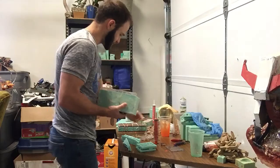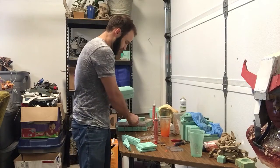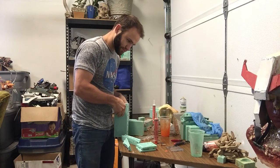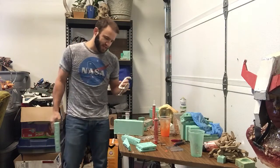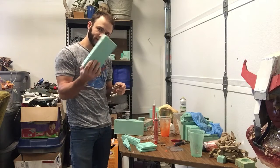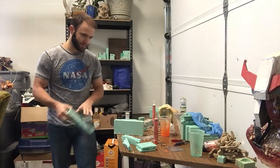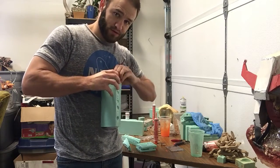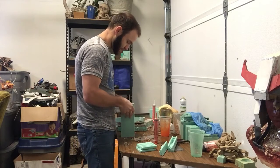You just pull these off, take them to your rubber band pile, pull off your shells. Sometimes you can use C-clamps, but that tends to deform your resin positives. So I like to use rubber bands and design my mold so that I don't have to use clamps.